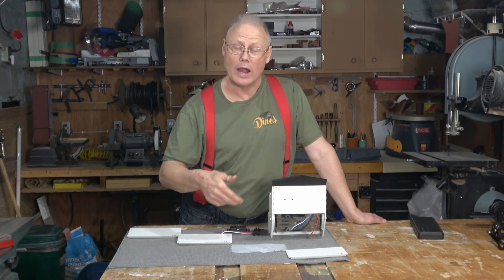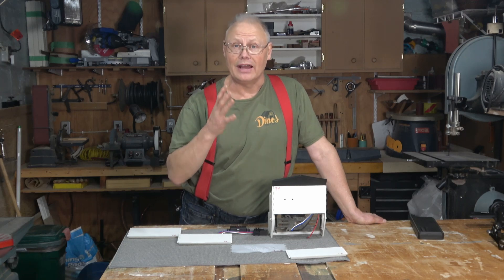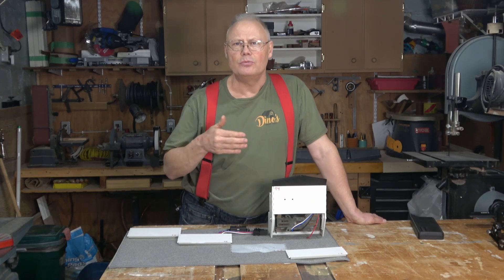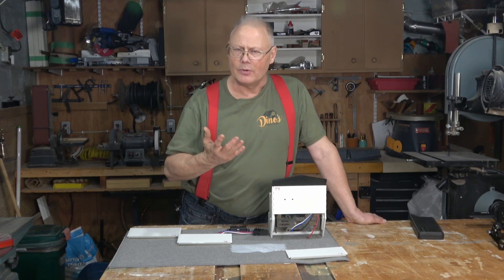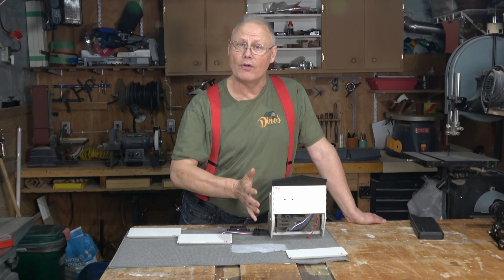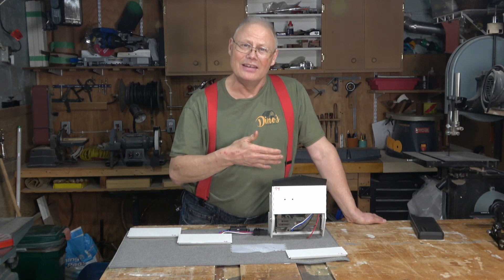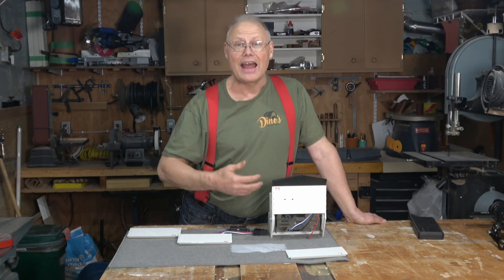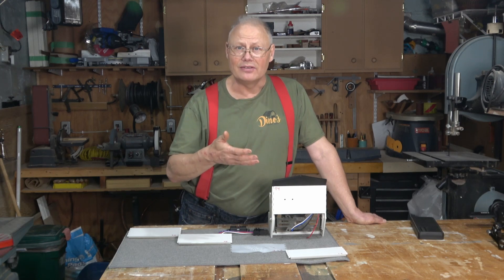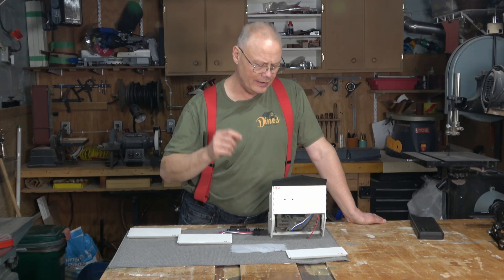The print itself, as it sits, is a total of seven different panels — if you include the dashboard panel itself in black, the others are in white. I can combine these in Tinkercad and print it out as a one-piece unit; I can do that at the end. But for the sake of refining each individual panel's details, it makes a lot more sense to print them in panel form, refine the different characteristics of each panel, and then fit it back into the overall print structure to make sure there's no interference and everything fits correctly, before having to print an entire dash every single time. It saves money, makes changes faster, and helps me visualize a single panel at a time.